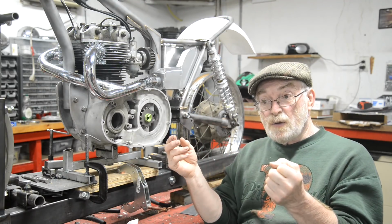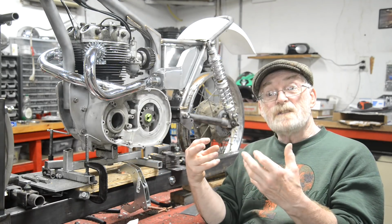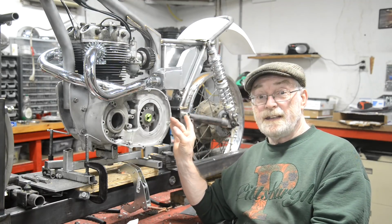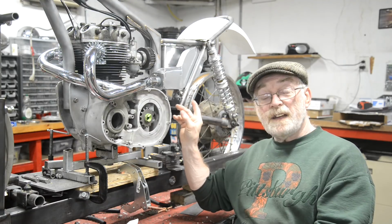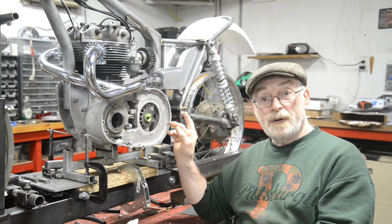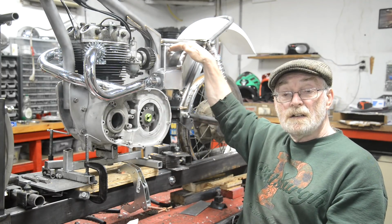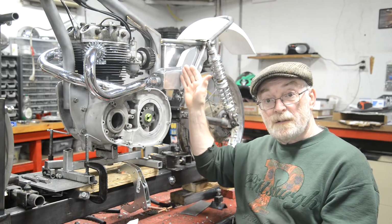Again, you've got to answer yourself the question, why do you put that on? You put it on when there's pressure. It gives you a much tighter grip when there's pressure in the line. There is, virtually, to all intents and purposes, no pressure in these lines. The outlet from the tank is, if anything, under negative pressure because it's the suction for the pump. So the only time that will be under pressure is when the engine isn't running, and then you're going to have the amount of hydrostatic head for the tank, the oil that's in the tank. So that's no problem at all.